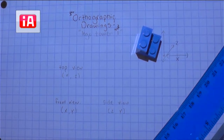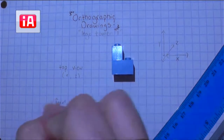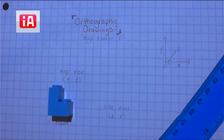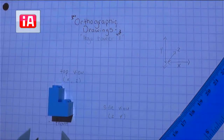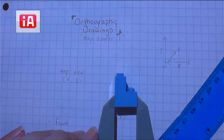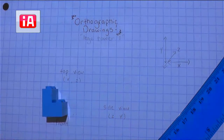So now let's go ahead and actually start drawing our orthographic drawing of Lego Tower One. When we're drawing orthographics, we're going to start with the front view. First thing I need to do is take some measurements so that I can draw the front view. So grab your caliper, and let's start by taking the measurement for the full width of our Lego Tower. Take the outer jaws of your caliper and place them around the bottom section — the full width of your Lego Tower One. Go ahead and take that reading, and share in the chat what the width is. Let's do this all in inches.